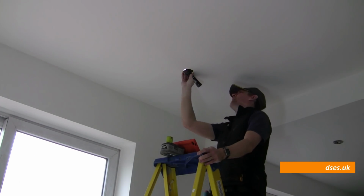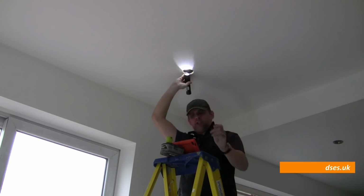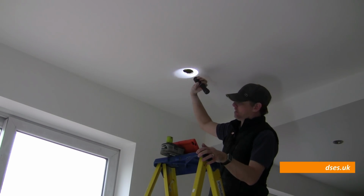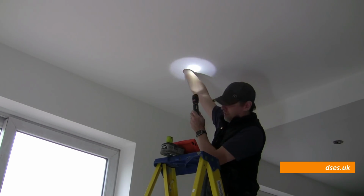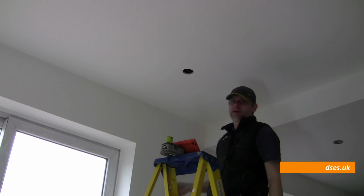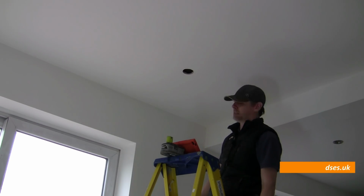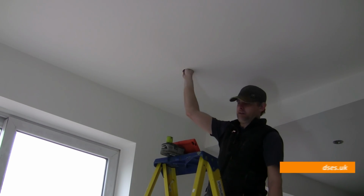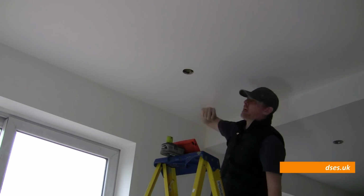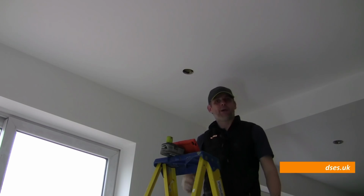But it's annoying, you know. I mean, this is supposed to be a quick visit this morning, and now we're going to have our day's schedule put out just because Nob the Builder has inexplicably moved our first fix cabling out of position before boarding the ceiling, and before engaging the plasterer to come and skim it and the decorator to paint it. So now, if we can't find our cables, we can't even open this up from below without damaging final finishes. I imagine he's moved the cables when putting in the insulation, but they were clipped to the joist, so he's gone to some effort to yank the cables off and fit the insulation without figuring that they need to be approximately where we left them.